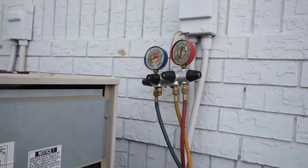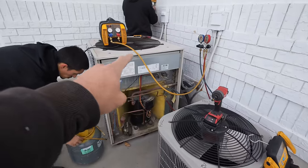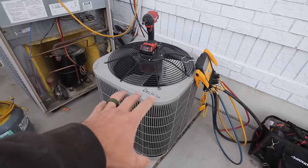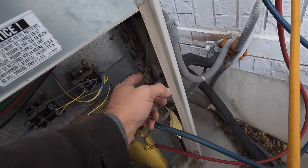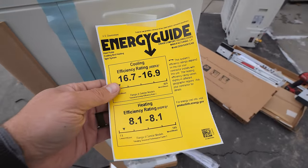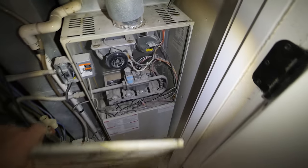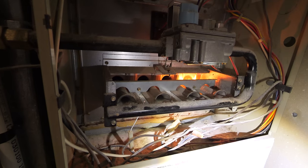R22 is out of date and only boils at negative 41 degrees Fahrenheit. The refrigerant for this old unit is back inside this bottle now. After the refrigerant is reclaimed from this machine, they're going to take it and recycle it. There's a bunch of copper and aluminum — these can both be scrapped and recycled like normal. The new heat pumps will use a new refrigerant called 410A, which has a boiling point of negative 55 degrees Fahrenheit — keep that in mind for later.